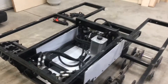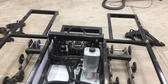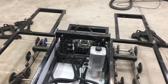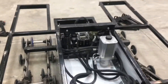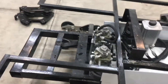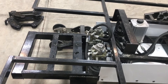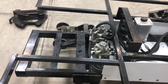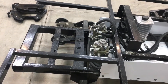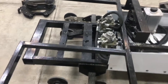I've also got a couple of little things to take care of on the chassis overall. I'd like to get the preload on the springs adjusted a little bit higher, just to compensate for the weight of the cab and materials. Aside from that, I might look at adding a bit of an underbelly pan just behind the rear axle, just to keep the belt from getting really covered in slush and snow. It'd be a bit of a pain since the machine is pretty heavy to lift, so I'll have to jack it up and look under it.